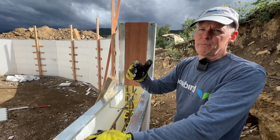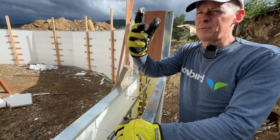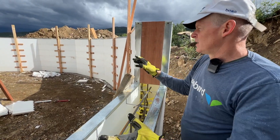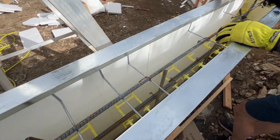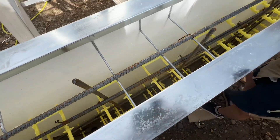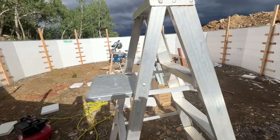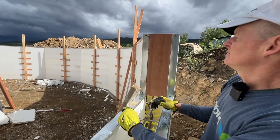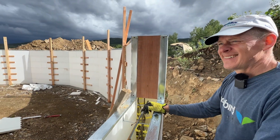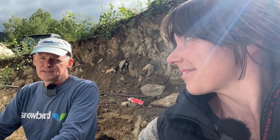We'll probably use ladders when we're filling it full of concrete instead of making a platform all the way around. We really only need to be two feet up in the air to look down in there — it's four feet and you can see in there simply. We finished the last piece of rebar on top. I still need to put the diagonals on — one diagonal on every one of those vertical two-by-fours on the common seams — and the end plate went on good.